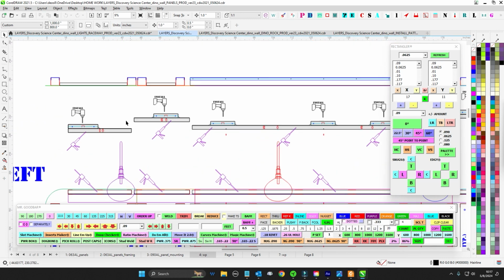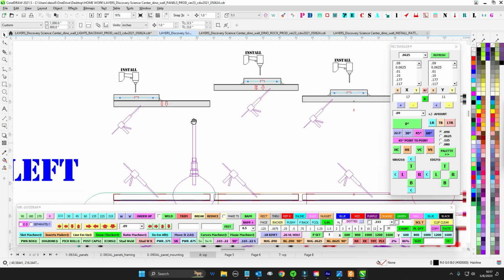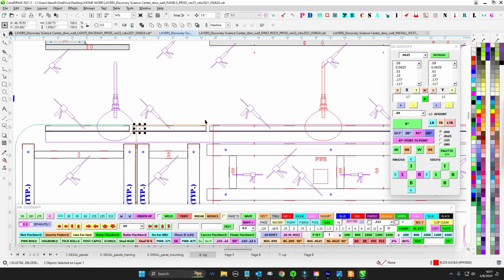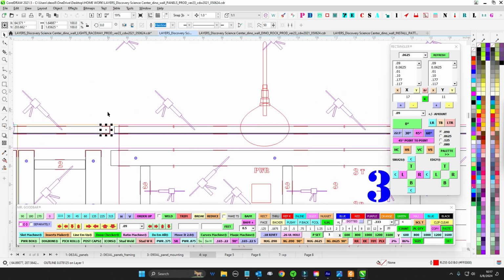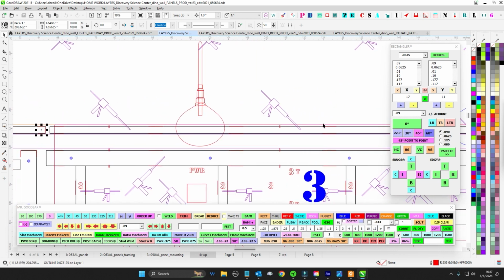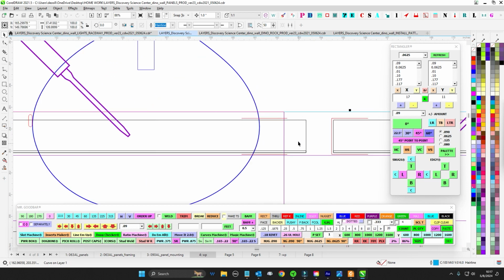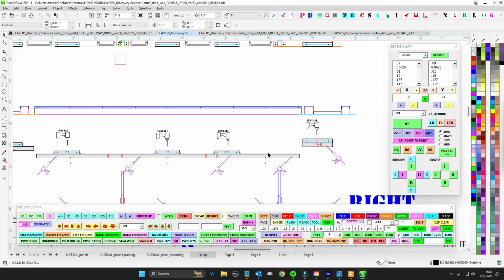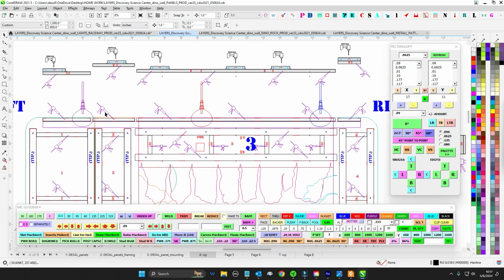And then on the top here, same thing, just follow the arrows, and you're just going to bend this up, and then you're just going to Lords it to the top inside the area here that's been scribed. This one gives you the end. This one extends over. And then same thing here. This guy goes all the way across, and then it helps stabilize. So this panel will rest on this a little bit. But it has notches again, so just make sure your notches line up, and you're just going to Lords it within the lines and make sure it stays.